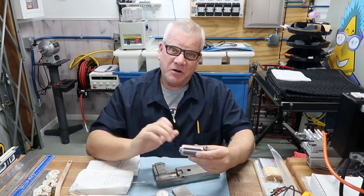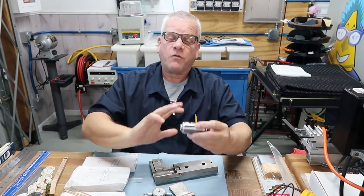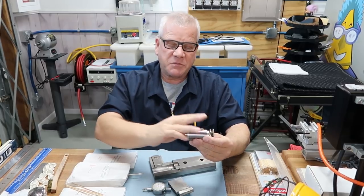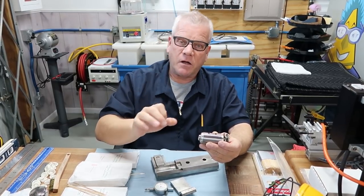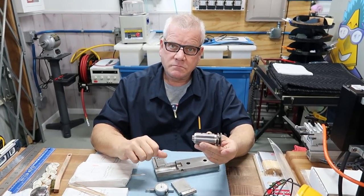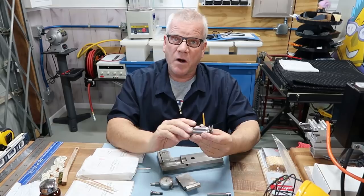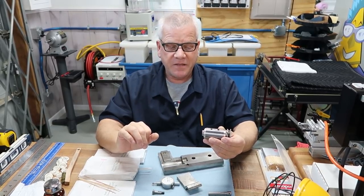This spindle isn't here to stay with me. I'll get it later, and I might have to do a little bit of work on it, but everything else will be done and waiting for it here on the micro drill. This spindle is one of the three spindles Patrick's going to be rebuilding, and he's doing two headstock spindles for those Levin Lathes. He's doing all that in the educational series. Is that correct, Patrick? That's correct. And remember, it's important to know that this has the same precision as the headstocks. Yeah, it has a total indicator runout of 50 millionths. So it's pretty tight. These are going to be fabulous.